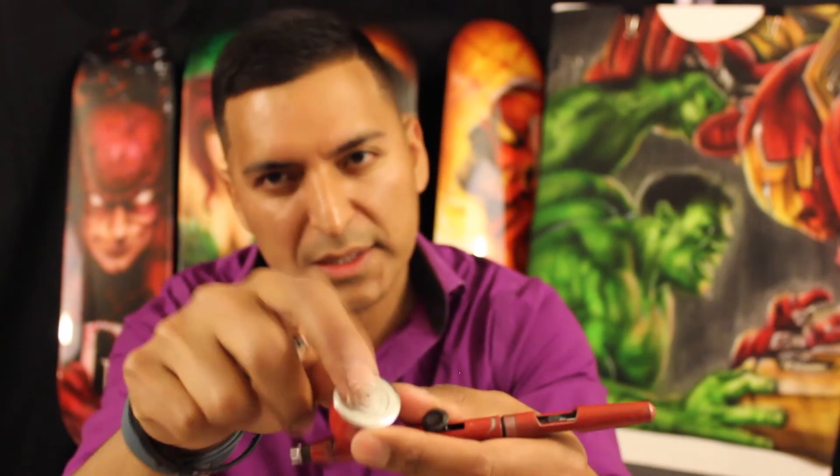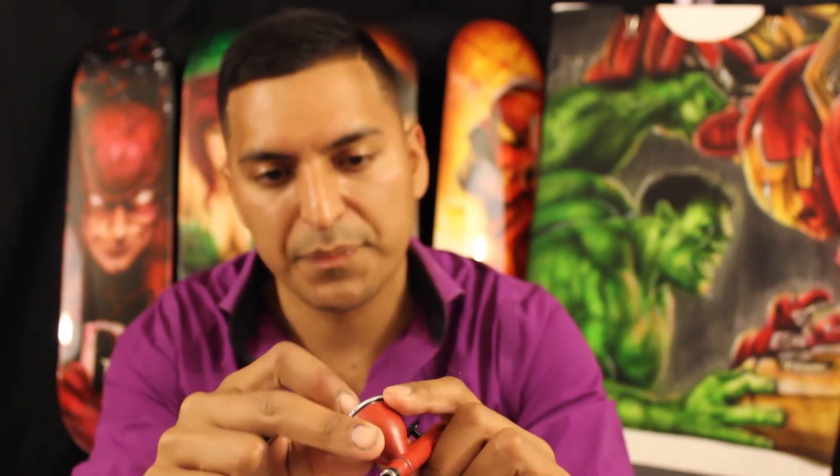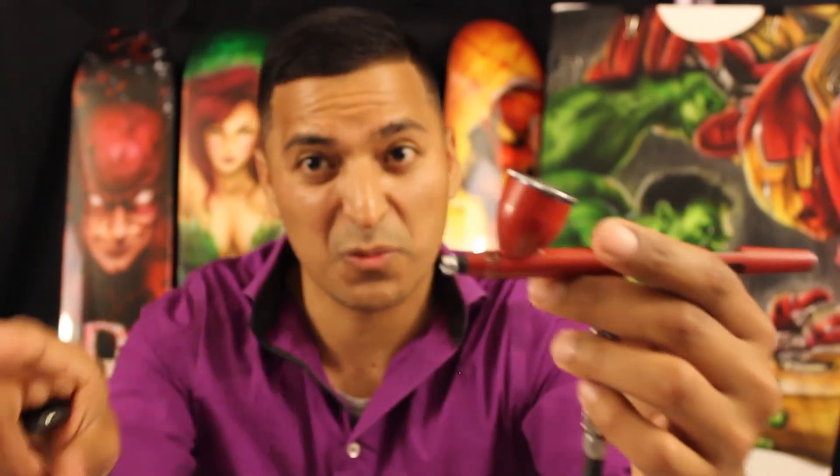Here's a little close-up. If it's not shooting that kind of wide spray pattern from all the way back here, then something's clogging your gun. Usually there are two main issues. There's a little hole on top of your cap — make sure that's unplugged, because air comes in there and it internally mixes and allows the paint to spray out really well.